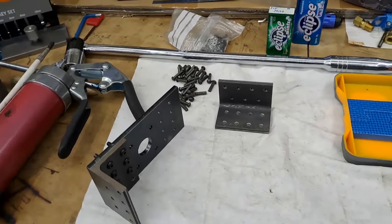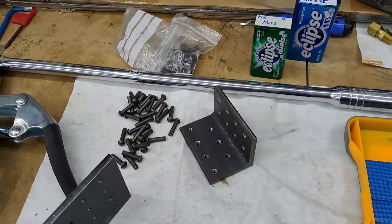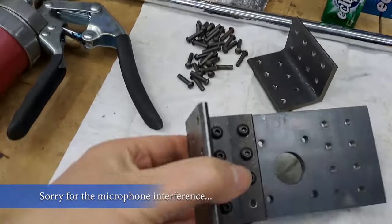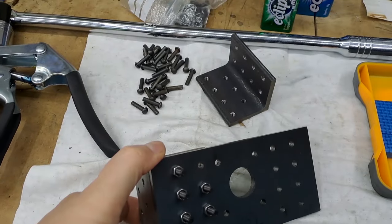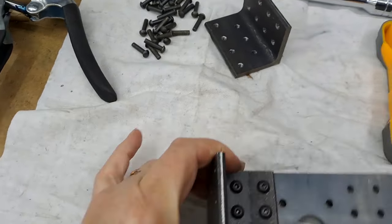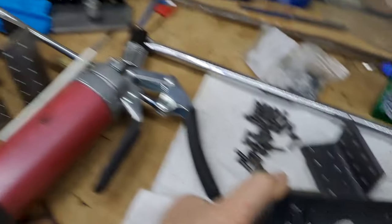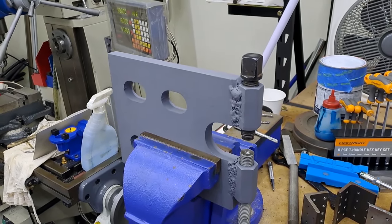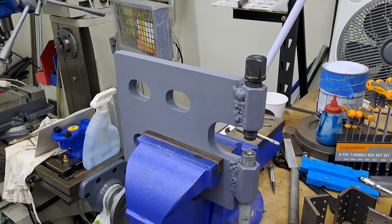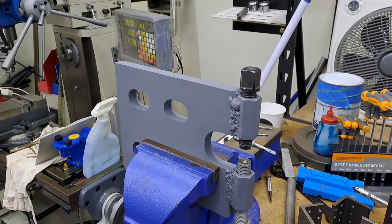Right guys, back again. Stripped the chassis down, cleared the bench a little bit. So as you can see, here's one of the pump stay brackets, nice and all drilled and tapped and everything ready to go. I've got the first one on the pump stay — eight holes to rivet, got seven bolts in there with nuts. That's just to make sure that while I'm riveting nothing moves, and I'll take those out one at a time. Put those in nice and easy using my little spanner set from a previous video. So easy peasy — now I'm going to get this into my homemade rivet press. Go back to video number 12 if you want a quick description on that.